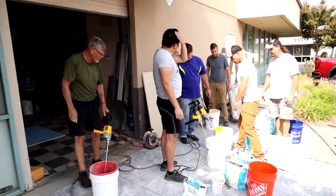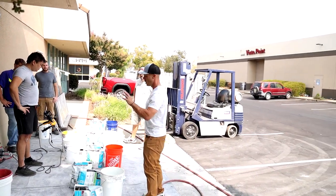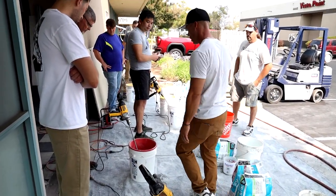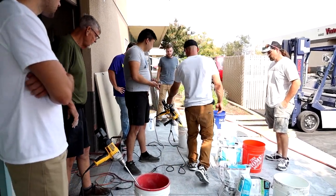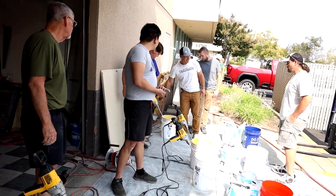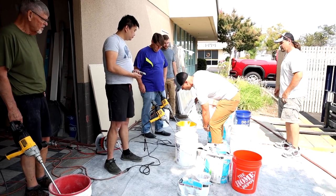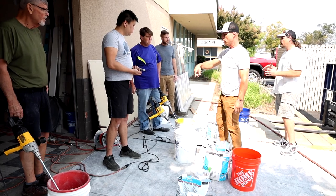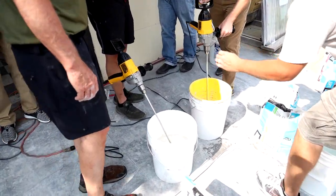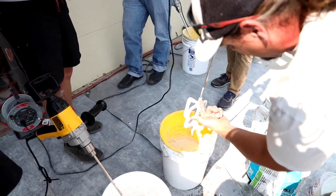We have different consistencies right now, which is perfect. Once you do your initial mix, if you notice it's too loose or you want it a little thicker, you can adjust. Spencer's is just about right — I like that for a floor mud. Some are a little loose. You can actually see the water content in the mortar right now — see how it has a glaze over the top, and the way it drips off. You can see that water content in the material.